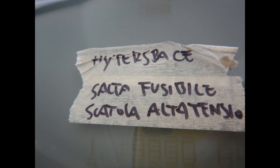It was an Atari Asteroids bootleg made in Italy by the company Rumiano in 1979. This sticker also reports the monitor's fault in Italian. It says that it blows the fuse in the high voltage CRT power supply board.